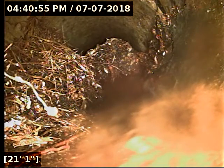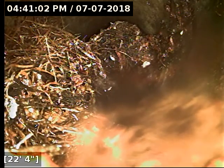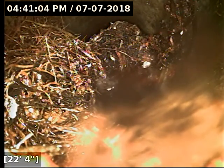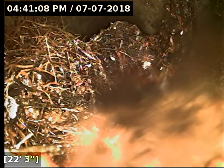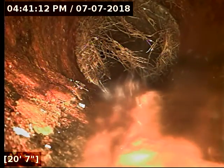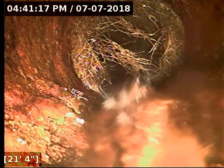We're all located and marked right here where the camera's stopped. Unfortunately, we're barely 4 or 5 feet outside the foundation here, just out from the clean out in the front of the house. I've marked with a white X here. We're at about 5 feet deep on the dot. We've got two root intrusions right back to back there, just as the cast iron transitions to concrete. We've obviously got a repair that needs to be done there.